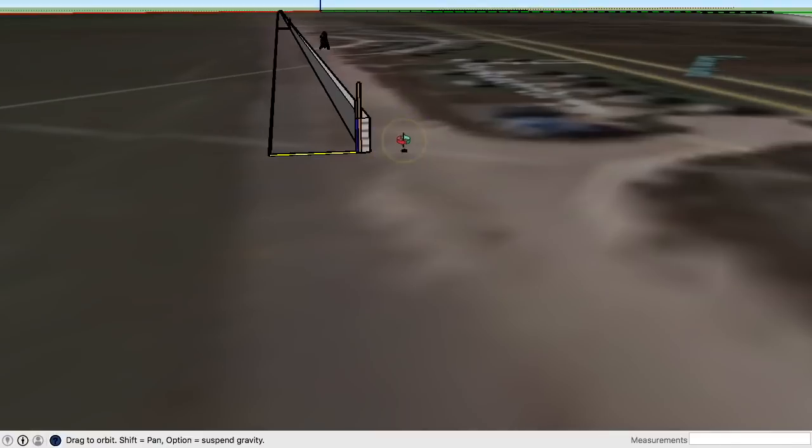All right, so they'll set a reference point here near where our first post is. They're going to shoot an elevation off of that, and then they can swing around, or maybe they'll have to add additional pins along the way. But what they're going to be doing is always shooting off this reference point here. And so they don't need to know sea level, they don't need to know anything other than the elevation of this starting pin.